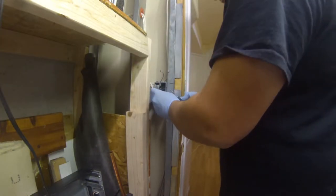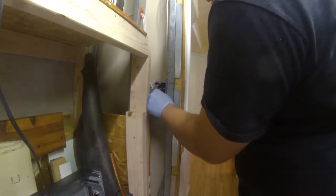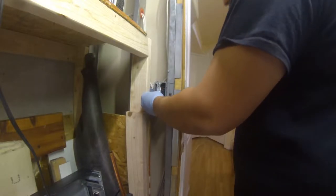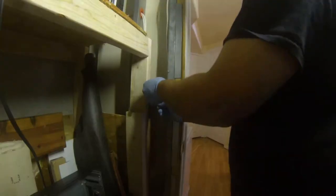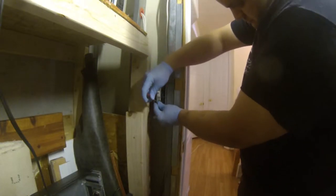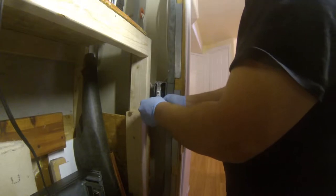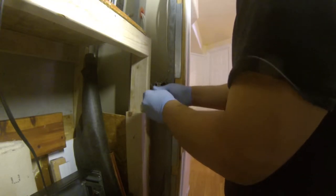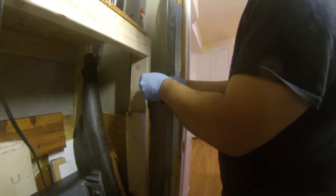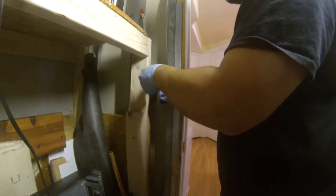This is light gauge wire for the digital switch input — we're going to push this back into the slot so there's enough room for the switch. We have to attach the switch: the blue wires need to be tightened down here. Squeeze those back in there and reattach the screws. It's been about 11 minutes so far — if you can get 15 minutes alone with the switch or outlet you want to install it in, you can get this done. With practice, you can probably do it in three to five minutes.